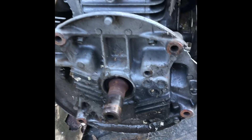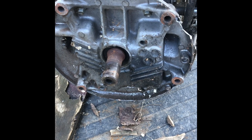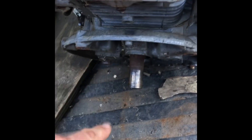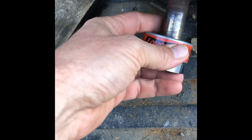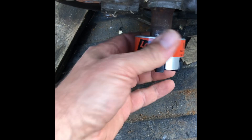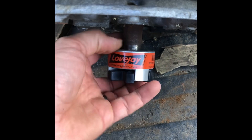Let's take a look at the size of it underneath. You can see that is a heck of a shaft — there are four bolt holes, and they are not lined up perfectly on this. There's a keyway on it, and that's where that 0.875 comes from. Let's grab that coupling — there's a keyway on it — and it fits just as it should, right up in there. Then I'll tighten that up and put it all together.